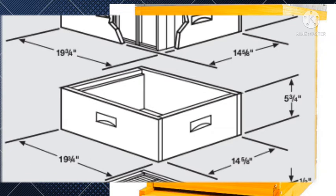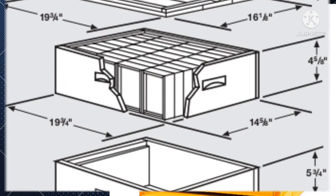Next, you need to make a section comb super — this is where honey is stored. To construct it, you will need pieces of wood measuring 19 and 3/4 inches by 4 and 5/8 inches — you will need two such pieces. Then another piece where one side is 14 and 5/8 and the other side is 4 and 5/8 inches — you will need two such pieces. Combine them to make a section comb super such as the one you can see in the video.